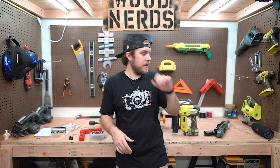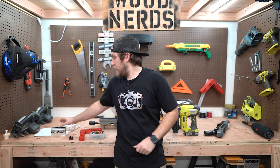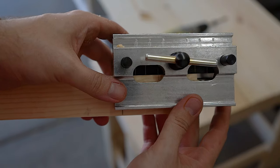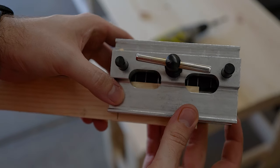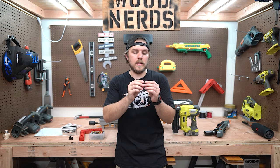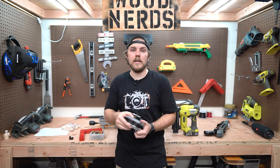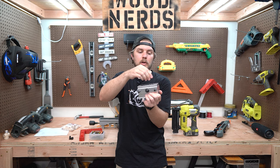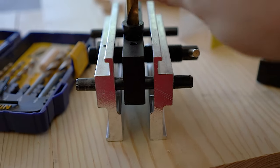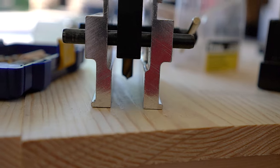This one's the most expensive and definitely not a necessity. First up is the dowel jig — you saw it in the video and this thing is fantastic. It's got a setup for alignment and I didn't have a single problem with it; it saved me issues. I use it in combination with dowels and these collars — the collar stops the drill bit from going too deep and lets me know I've gone deep enough, so it's not too shallow or too deep. The dowels fit just perfect. The little collars are really cheap too.